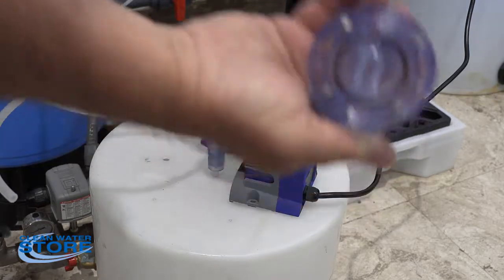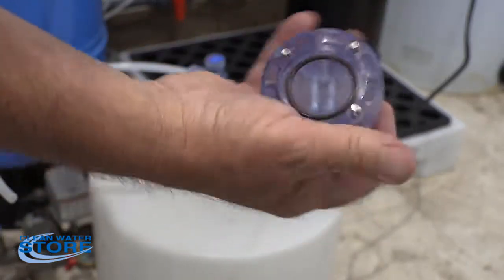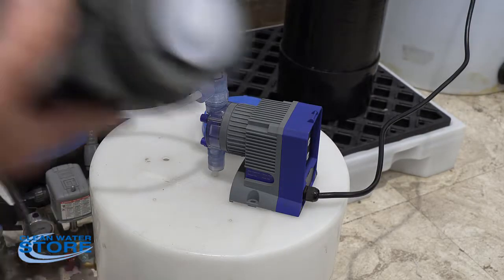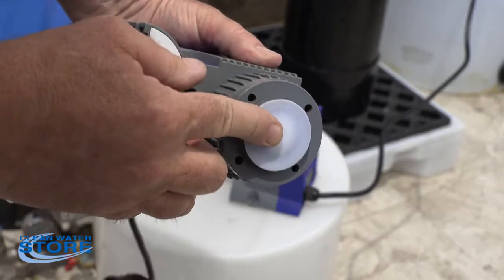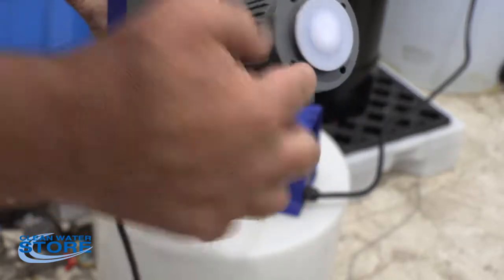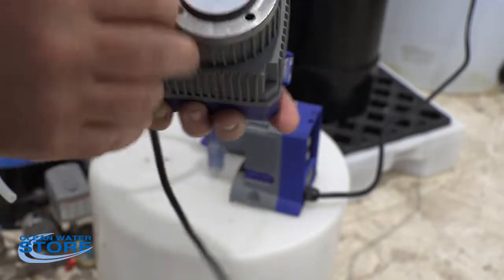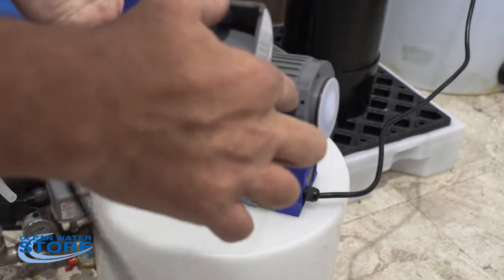Okay, so when you pull the back head off, you can see here's the back of the pump, and there's an O-ring that seals. And then the pump itself, you have a diaphragm here. There again, you notice this ring on here and the hole in the bottom, that's your drain. So when you reinstall it, you want to make sure your holes line up, and that's there.